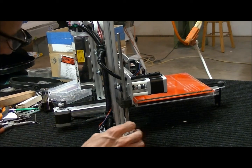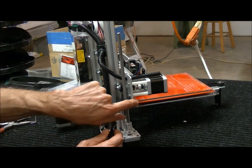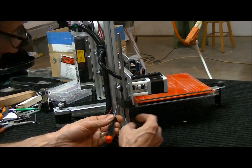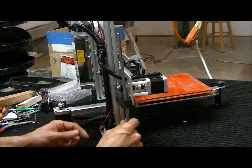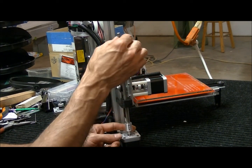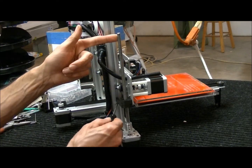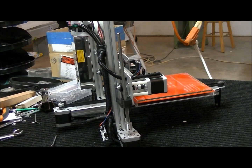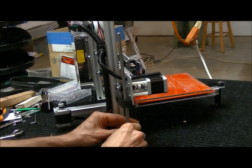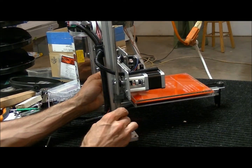So now we need to get the clip that was in here out. The only way to do that is — that's why we loosened up these two screws over on this side. You can't pull it out because this thing is here. You can do two things: you can loosen this up and pull the whole thing out, or you can turn this and make this thing come up here. Because there's more play up here, you can probably pull it out and slide that thing up. I think I'm going to go the route of removing this. Got to raise this a little bit. So I've got that out.